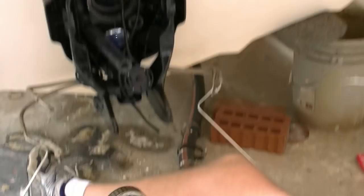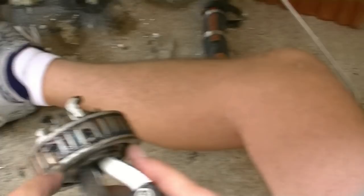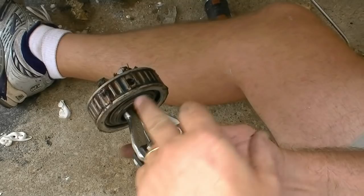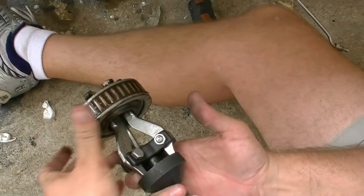Now there's a little hole right here - you can see it? That is lined up with your grease fitting on the outside of the boat. So when we put the new one in, we need to make sure that this grease fitting is exactly lined up when we tap it in. I'm going to scrape all the old pookie out and clean it up good. We've had the other gimbal bearing sitting in the freezer for like two hours, and what that does is it slightly makes it smaller so it will slide in a little bit better. So I'm going to clean up a little bit now.